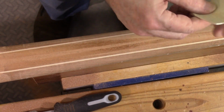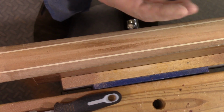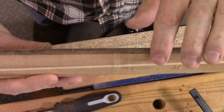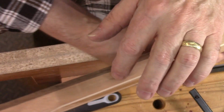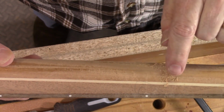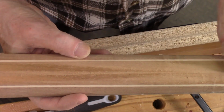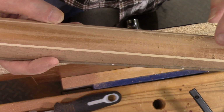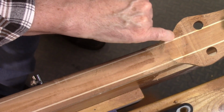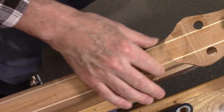What my finger felt, you just saw those first few passes. Since this feels straight, I can now visually see, because of what got sanded and what didn't, these light lines. That's because that was the high spot where the sandpaper hit more than here. And again, there's a little spot right here, see the line? Where I circled it, you can see that little line there. My finger felt it first, and then running the sandpaper, just those couple of passes confirmed, yep, there's a little high spot there that just needs to get knocked down with the sandpaper. This is now where you've got that scarf joint that was at an angle. That's what's showing now. I'm going to slowly work that back so that it's hidden in the curve. And that's just patience. That's really what it comes down to.